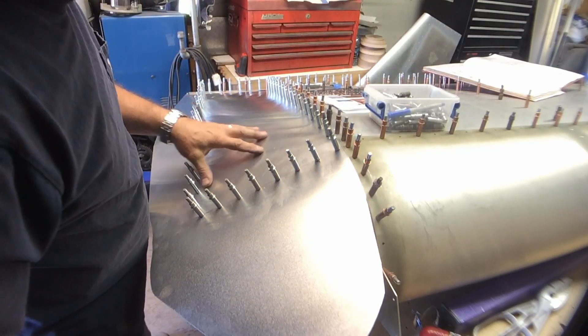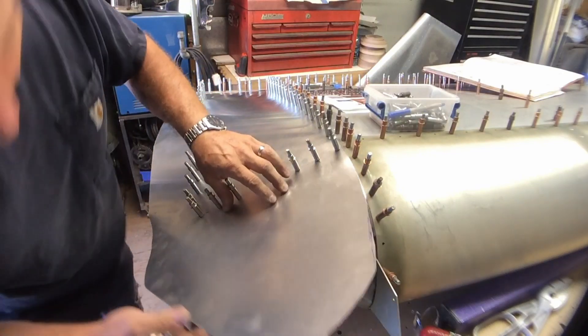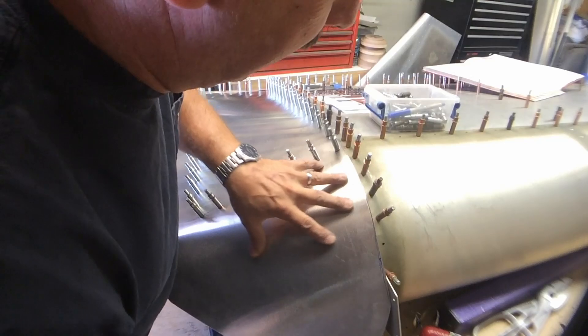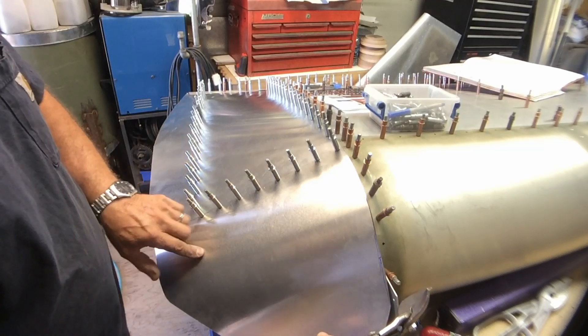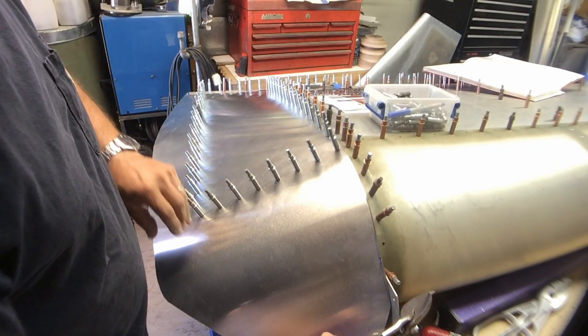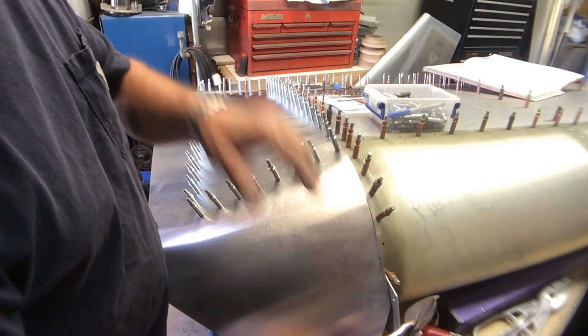All right, I'm pleased with that — that looks pretty nice. I'm going to go ahead and fit it on down here and fit down what we can to the top, probably down to here. Our two holes down here will match drill those with the strap finder duplicator, and we'll go ahead and Cleco all those. Then we're going to roll the wing.